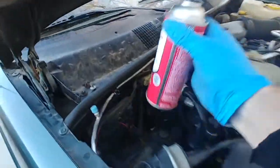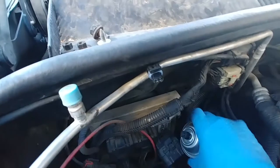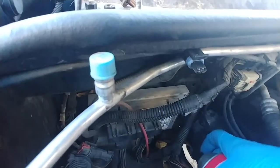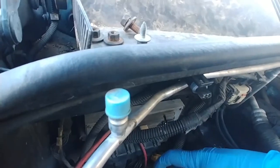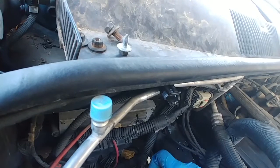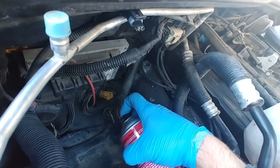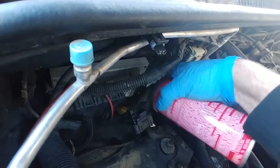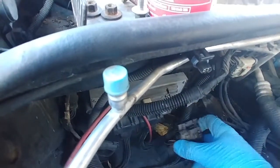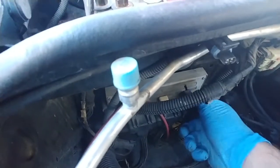Some contact cleaner. Pop this thing off, spray some in here. Trace them in here — it's hard to do with one hand. Get it all in there. Let that dry out a little bit — dries really fast. I'm going to jack it in and out a couple times to clean it. Maybe I can work off any corrosion or dirt in there.